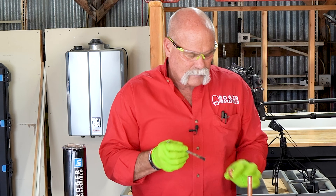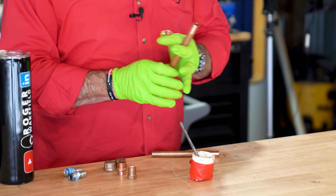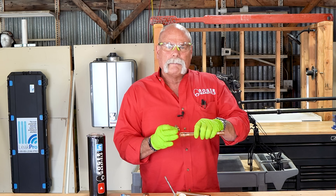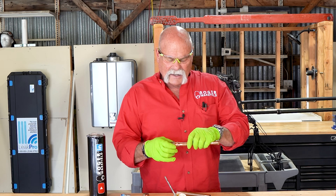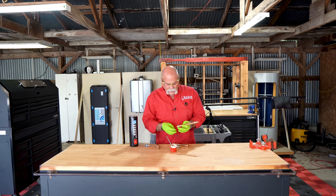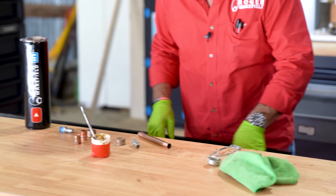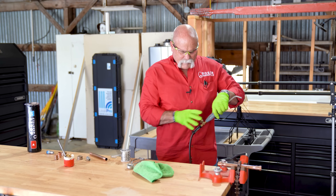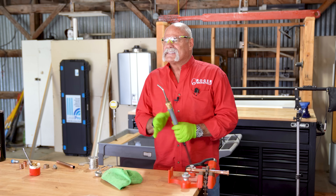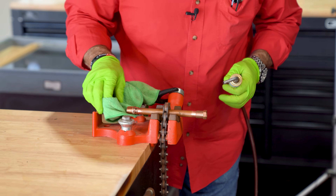The reason we're doing this is we want to test these solder joints. We could put a cap on it, but we may want to bleed out some of the air. So we put a threaded male adapter so we can put a cap on here and tighten it up, then put another adapter so we can plug it right into our blast chamber. Today we're just using a small tip — this is a turbo torch so it gets hotter than a Prestolite, but we're just working on half inch so it doesn't need to be anything big.